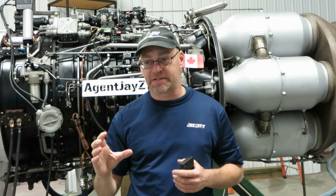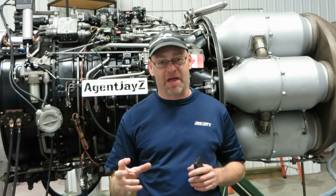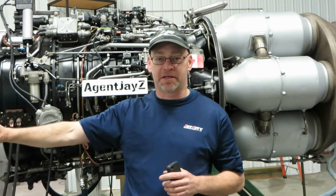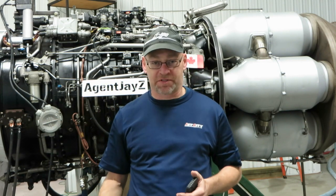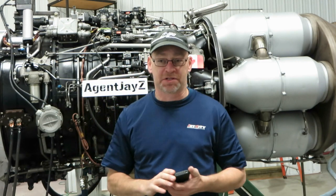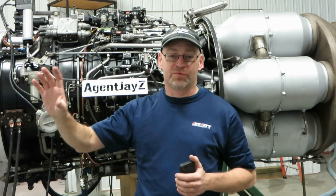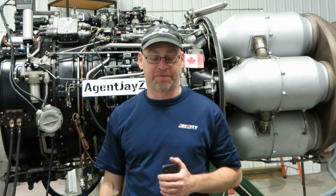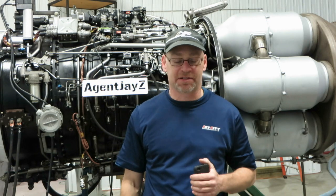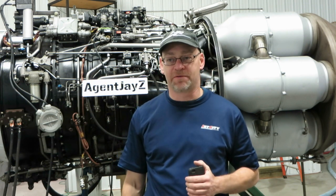A power turbine is very similar to an LP turbine in a turbofan engine, except it takes as much energy as possible. In a turbofan engine, maybe 10 to 20% of exhaust energy remains in the low-pressure turbine exhaust and is expelled as thrust. A turbofan has two thrust sources: the bypass air, which is cold, and the core exhaust, which is hot. There are no industrial applications for a turbofan — unless you wanted to mount one stationary as a giant wind machine, but they're just too powerful and would destroy things. There are many clips online of buses, concrete blocks, cars, trucks, even buildings being blown apart by large airliner engines.